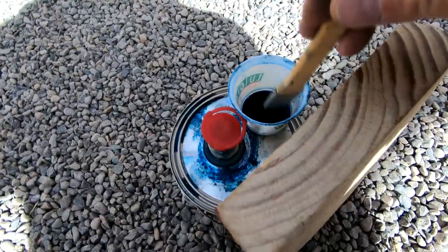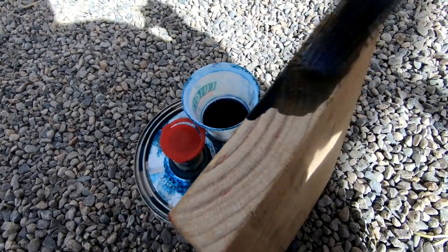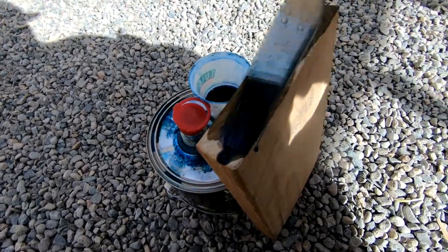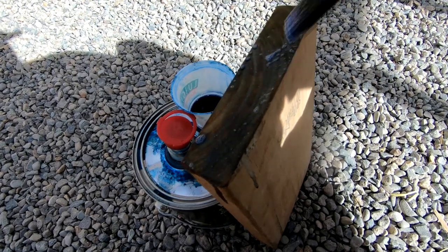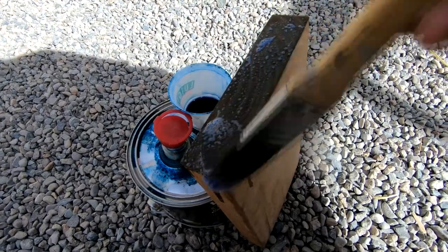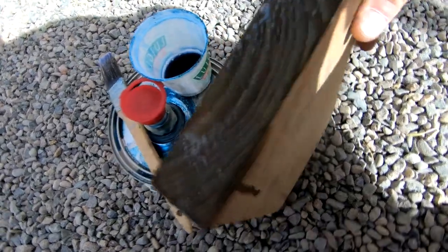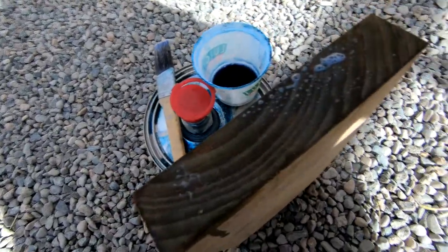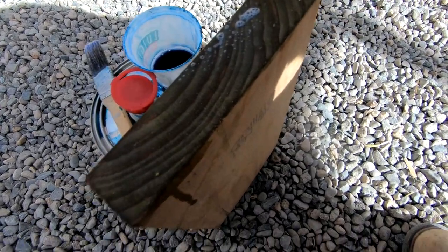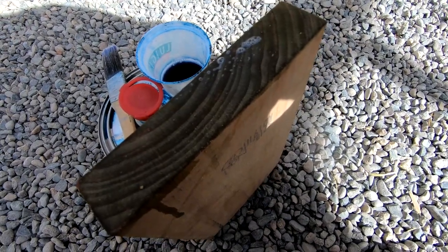So because we're using treated lumber for this basement, because it's going to be buried, every time we make a cut on this treated lumber, we have to put some more of this treatment on the cut to protect the wood from critters. And that's what Robert's been doing. I'll cut the pieces, Robert's been painting this stuff on, some kind of copper coat that keeps the bugs away. But anytime you cut treated lumber, if it's going to be buried, you need to treat the cut so that the wood will last and not be invaded.